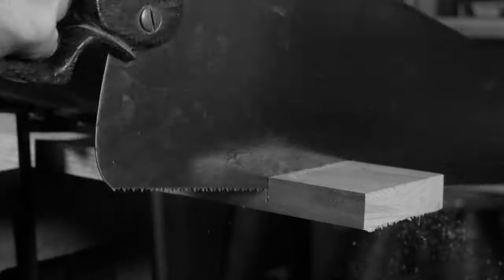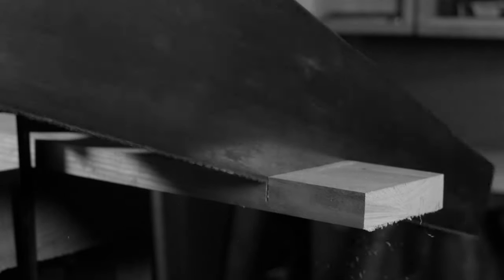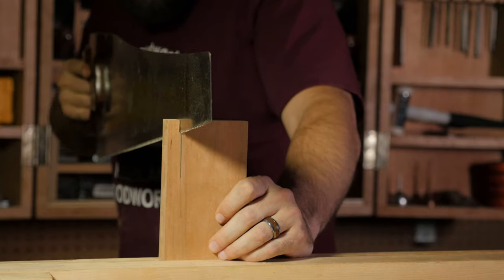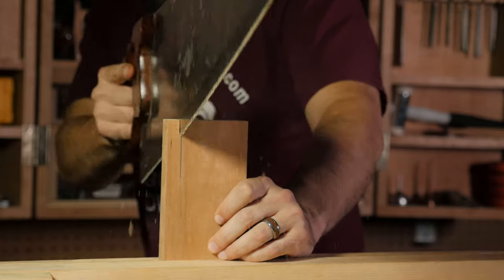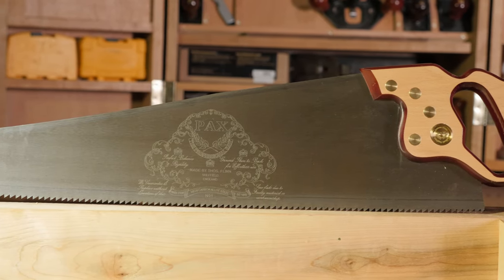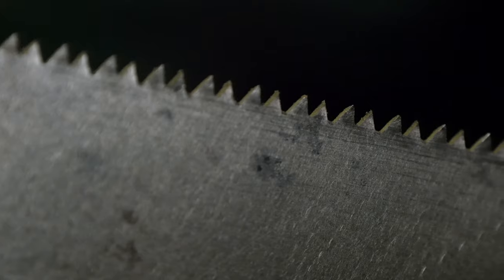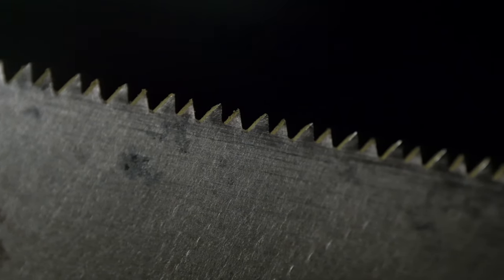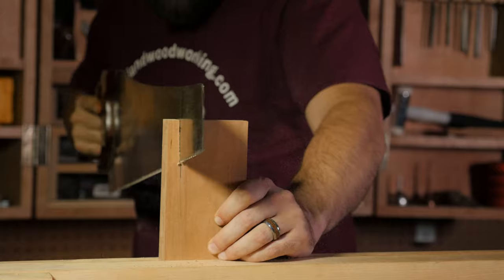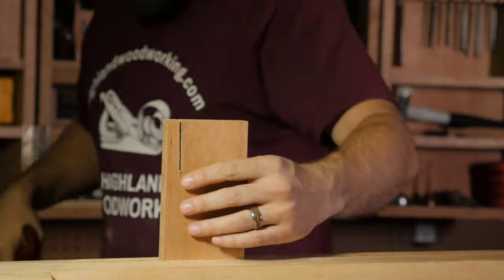When you think of a hand saw, you might picture an old tool from your grandparents' tool shed, and you might have even tried one with varying results. These hand saws are the workhorse for rough dimensioning — cutting a board to length or cross cutting across the grain, and to width by ripping along or parallel to the grain. These saws are 26 inches in length, or their shorter version in 16 to 24 inches are called panel saws, and have their teeth filed in either cross cut or rip. The teeth are filed differently for different purposes: cross cut teeth are filed at an angle, much like a knife edge, whereas ripped teeth are filed with a straight edge, much like a chisel. Using the appropriate tooth filing for the appropriate cut will result in a much cleaner and more efficient cut.